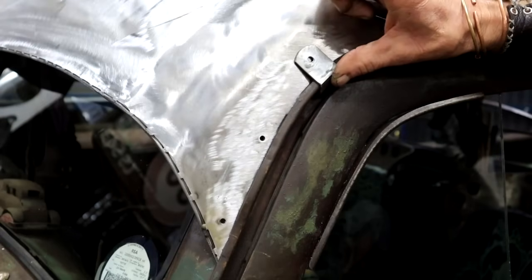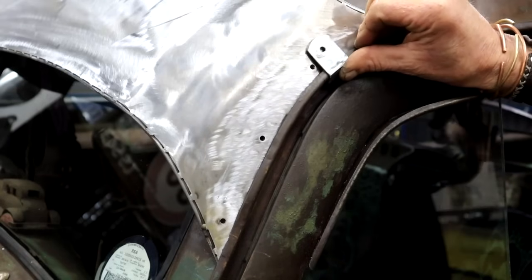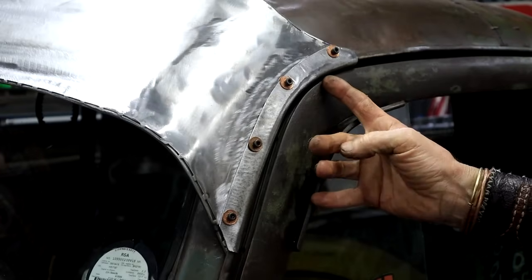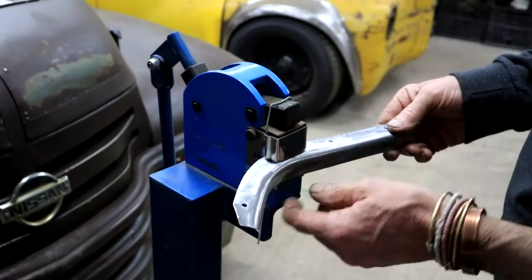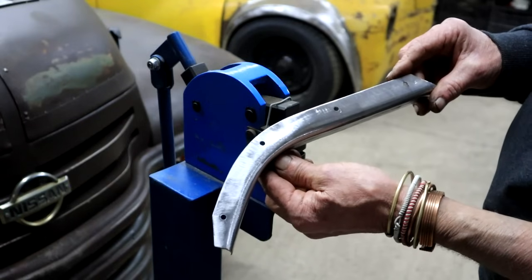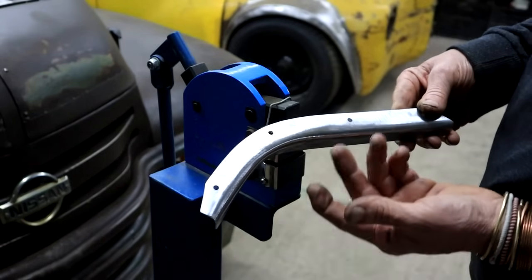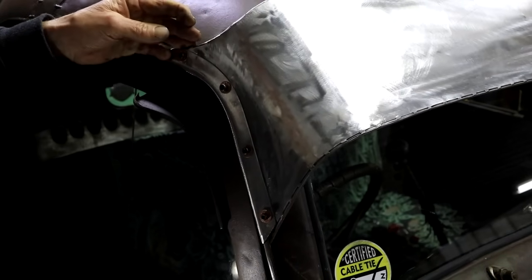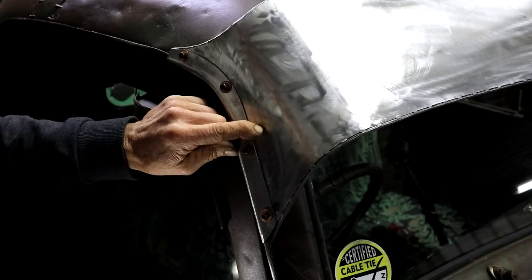For attaching my sun visor, I was going to use those L-brackets — but I've changed my mind. I decided to do this instead: I bent up an L-shaped section of sheet metal and then spent some time in my stretcher to get a matching curve into it. I think I've now made a much more elegant clamping bracket — not that there's anything wrong with the functionality of those L-shaped ones, but this is just a little bit more refined. And that clamps it on really well — it's not moving at all. If you don't have a stretcher, don't stress — those L-shaped brackets do a fine job too.